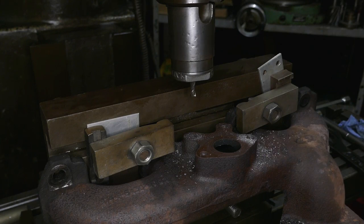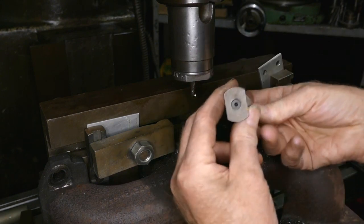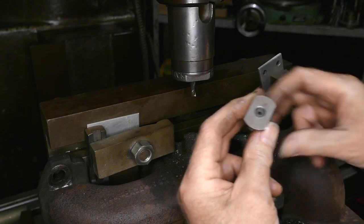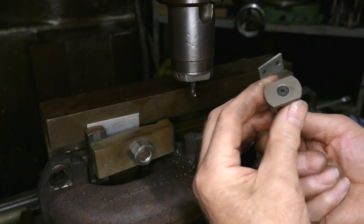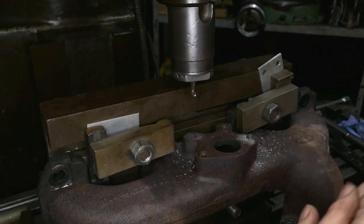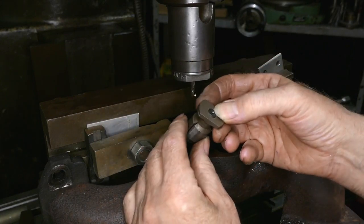But what you don't want to have is a gap here. The temptation is to wind the cutter in until that's flush — and that's wrong. It needs to be below that. If you do that and put it in there, this bottom nut will not get to the top before it's tight, so you're lacking the rigidity. And I don't know if you run the risk of cracking the end of the cutter, but it's not the right way to do it.